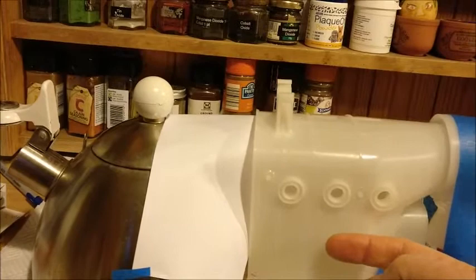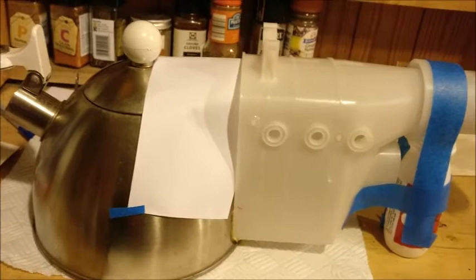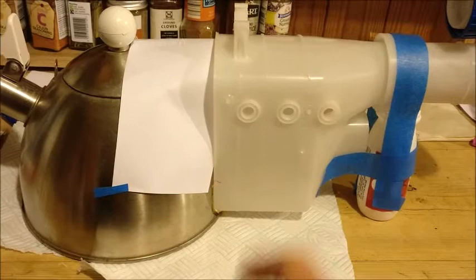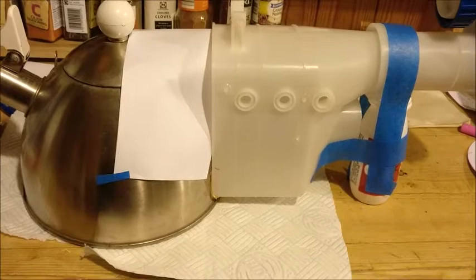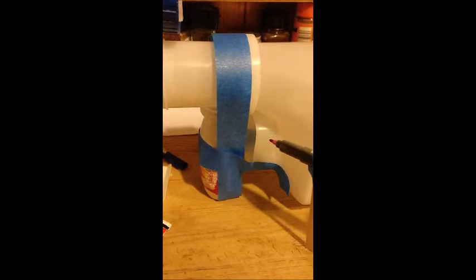Draw that line on all the way round by measuring the height from the surface and trying to get it as straight as possible. And then cutting, which will need different cutting tools and the Dremel, and will make a lot of sparks and a lot of nasty melting bits of fraying horrible plastic. Let's hope it will be worth it. I've just taped a pen to a tongue depressor, and that'll be used to mark the height.